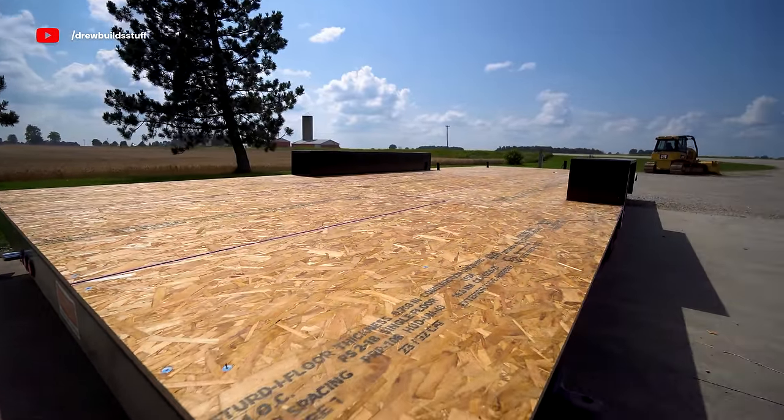So this first side of the ridge beam will meet at that center cedar beam. And then I split this second side of the ridge beam into 3 pieces so that the joining points are overlapping. With all the pieces up, I nailed the LVLs together using more framing nails. And I'd do a line of nails about 1 inch apart, every foot or so, alternating sides on each run. And now that's a pretty overkill ridge beam for what this is.